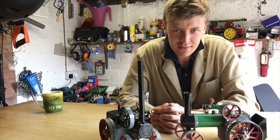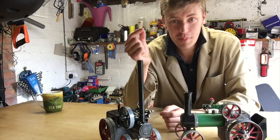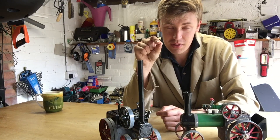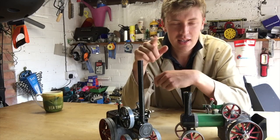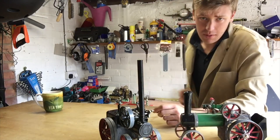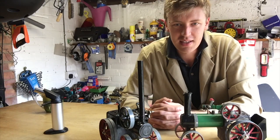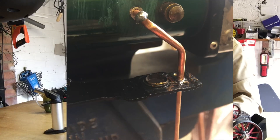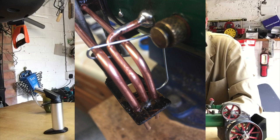Then came my new skill with this particular product: soldering a copper pipe. Very simply, you take your copper pipe and you put it over the hole that you want it to be soldered onto. Get a cocktail stick, push it through the hole into the pipe and it will hold it there for you. Then take your solder, wrap it around the outside of the copper pipe against the hole and then go out and buy yourself one of these — a kitchen blow torch. Light it and melt it. That's basically it. The first photograph shows the cocktail stick going up into the pipe from through the engine plate. The next one shows it just been soldered — it's still smoking, which funnily enough is the cocktail stick because that caught fire. Then the last one is the three pipes all in place and ready to go.